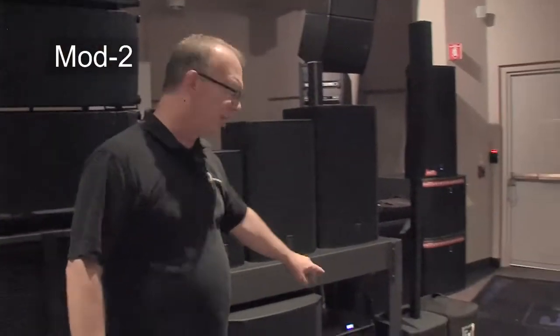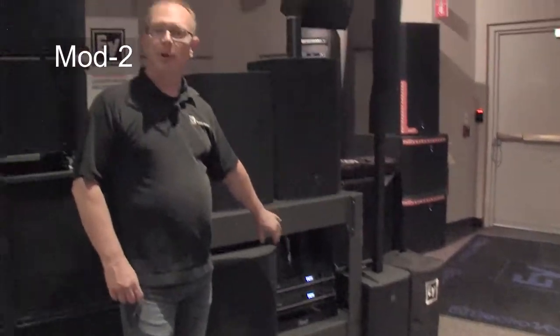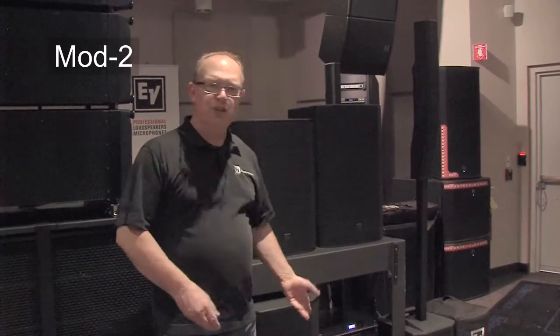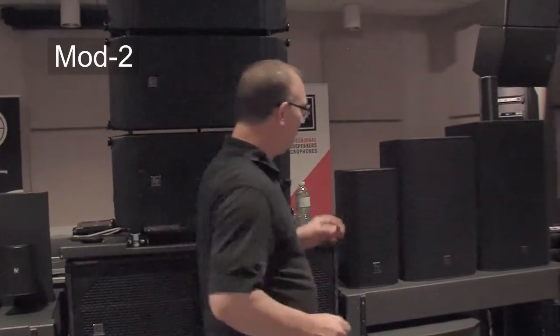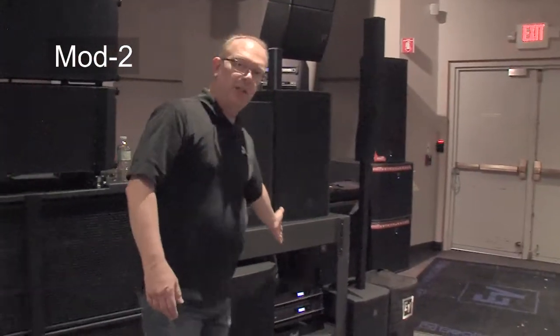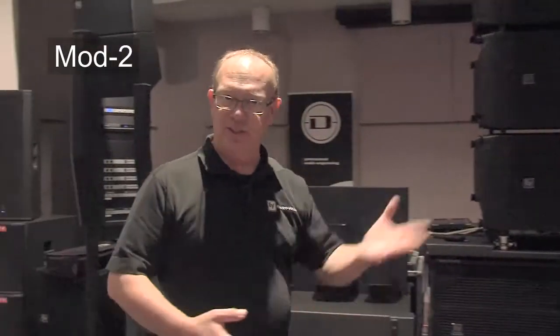The live versions have a front panel power switch versus the contractor version which does not. It also has all the DSP built in, but uses XLR inputs for bands and for places like churches and theaters that might have things going in and out instead of permanently installed. It also has the DSP built in and Neutrik NL4 outputs. That's what's going to be powering the EVC rack. Once I move over to the EVC rack in just a minute, we're going to be dealing with the L-series amplifiers, which have downloadable speaker tunings inside them — that's what handles the sound processing.